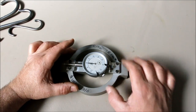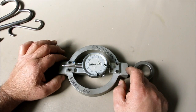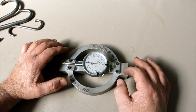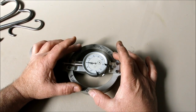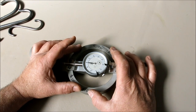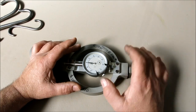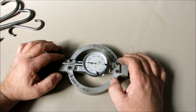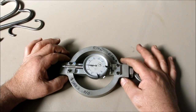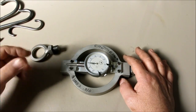The ring of this is made out of 7075 T6 aluminum, which has a 75,000 PSI yield strength — which is pretty high, much higher than regular steel. It's easy to machine, so that's kind of why we did that. If it was steel, we would have to have a heavier ring and we'd have to load it to a much lower stress. We can actually put a little more stress on it than you can with just normal steel of the same size — this is actually stronger than steel. It's not as stiff as steel, but it's stronger than common steel like that.